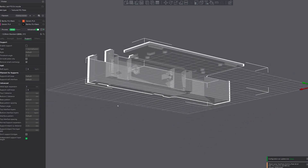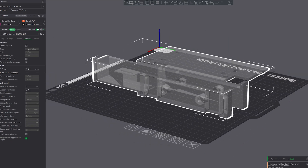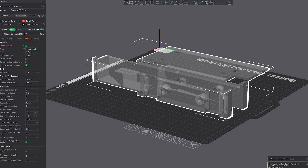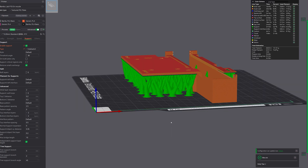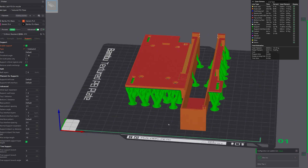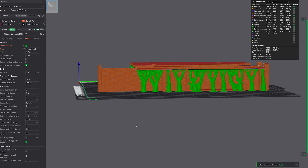You should try some of these prints too, which I have linked in the description below. Adding support means your print is much more likely to be successful. Without supports, you'll get a lot of stringing and drooping, which is probably not what you wanted. For example, let's look at a model from a past video where I tried to extend the domino tray and the halfback domino robot. While each separate part can be rotated to print without supports, you don't get the luxury when you want to combine them and print in one piece. Even with the most optimal rotation, we still end up with a ton of overhangs that need supports, and in a lot of small areas too.